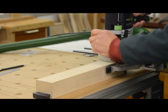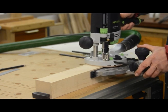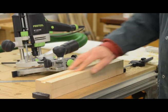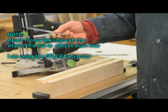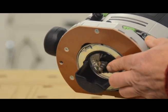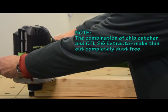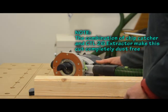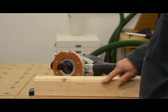I'm going to do my plunge, lock that off, and here I go. There we have the most beautifully clean cut, absolutely spot on the five millimetres set up on the turret. I've now put the chip catcher on and got a Roman OG bit in, and we're going to use this to do a cut. Well that was hardly difficult — my bit is a little rough and ready, but that went pretty smoothly.